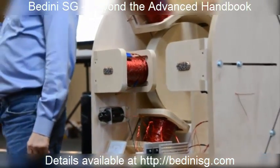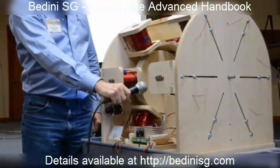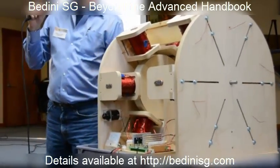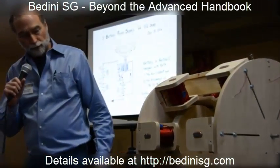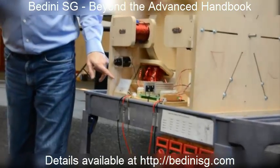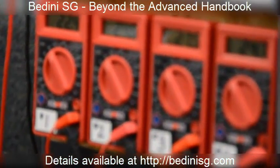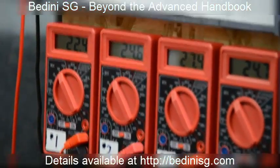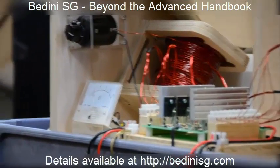I've got a tachometer here. This thing gets up to about 850 RPM — that's where this thing goes. As it goes faster, more pulses per second, so it starts drawing a little bit more current, back up to almost two amps. The way to keep it accelerating is to keep dialing it down. I always wanted motors like this — the less you give them, the more they give back.